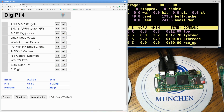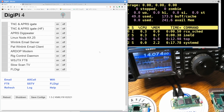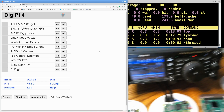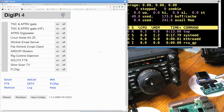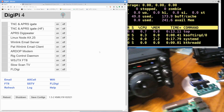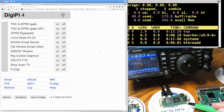Back to the Raspberry Pi Zero 2 Wireless — I think that's the first time I got it right. We've got a DigiPi actually running on it, connected up to this Yaesu 991. We are on an FT8 frequency right now. Normally a DigiPi would come with an audio board, a stacking header, and an optional monitor that displays status and call signs going by. I don't have any of that set up yet — in fact, the header isn't even soldered on yet. This guy is headerless.